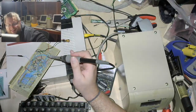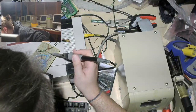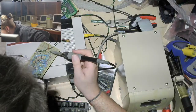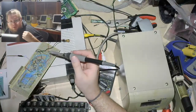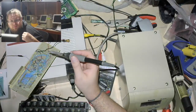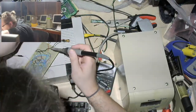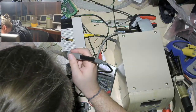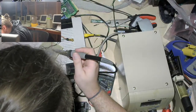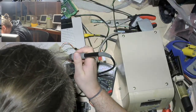Then nothing. After 2, there is nothing on 3, 4, or 5, which is fascinating because there definitely appear to be things connected to those pins. Huh. Oh, are those just signals? Oh, yeah, that's going to be A17 and A18, which I am no longer using. Right. So A17, A18, and nothing. I will get rid of those, which will give me more places to put inputs. More not quite as high order bits for checking my EEPROM area mapping doodad.